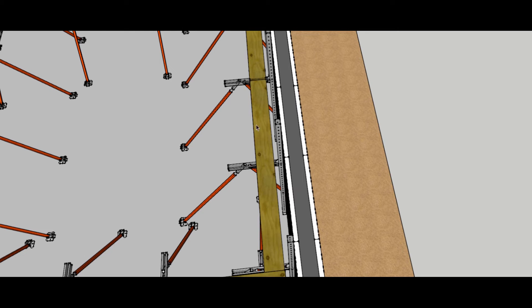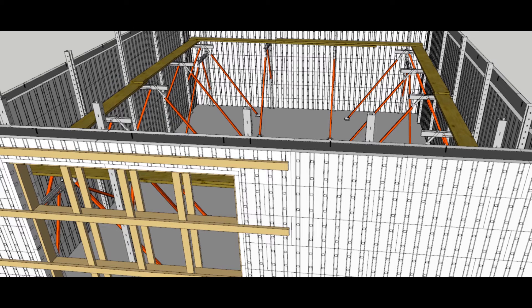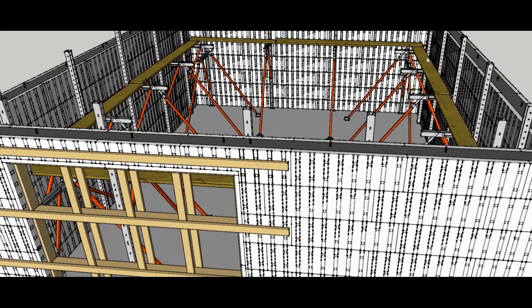We're going to set our anchor bolts and use the foot plank to go on top of the wall. I like a wide enough plank to cover all the concrete — I don't want any wicking of cold coming up through the concrete; I want that capped off on top. Code requires a bolt at least within a foot of each end of each plank, so we got a bolt on each side where each plank ends, and otherwise it's every four foot on center.